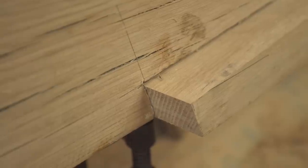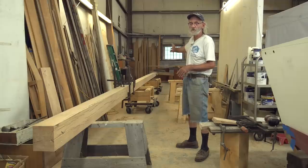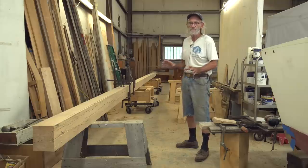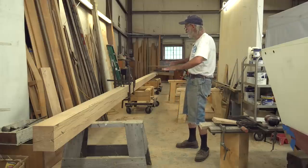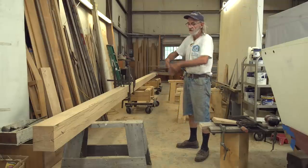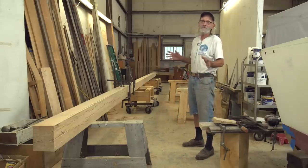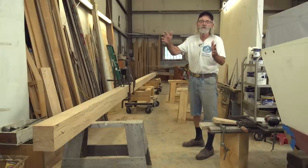This thing fit pretty nice, actually, when I had it clamped together - so this is a huge step ahead. The next thing I'm going to do is place on the forefoot. I've got a nice curved piece like a Novi has for the forefoot, and then we're going to put the stem on the forefoot. That's where we're going - the whole centerline first. We're going to put it on its side to do the connections because it all sits on horses like these roller dollies. Once that's connected, we'll tip it up and put the sternpost in, because it's going to be mortised down into the timber.